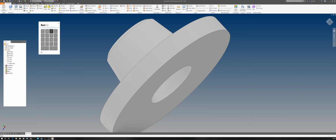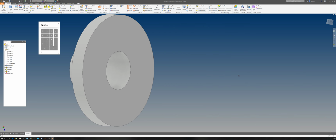Now then, on this side, welded flanges are usually raised face, which means an area around here is raised, where the gasket goes to seal the joint. Excuse me. So, we have a dimension for that, of course. Dimension G, which is 92.1.